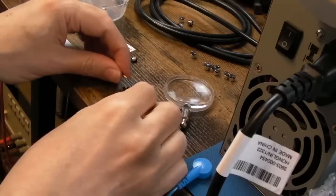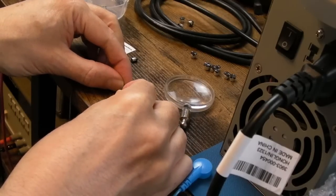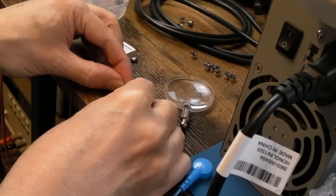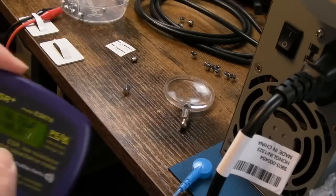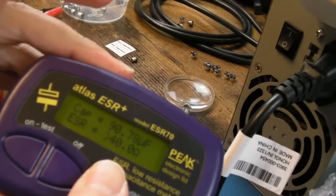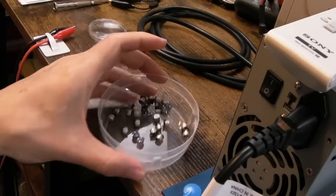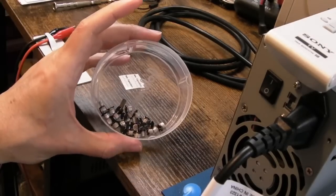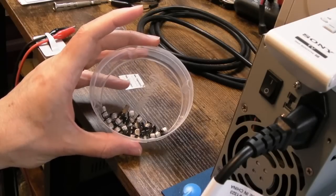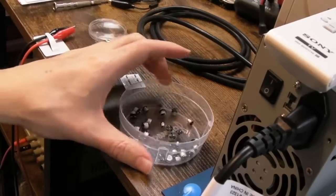Got to show you this one. It's the first time my meter has made a sulky noise. Hang on. Did you hear that? First time I've ever heard that noise from this meter. It's very wrong. Greater than 40 ohms. Good God. Most of those were out of spec. 3 or so of them were over 40 ohms, and there were 2 or 3 that were around 22 ohms, and 2 or 3 around 5 or 6 ohms. So it's a good idea that I swapped those out.